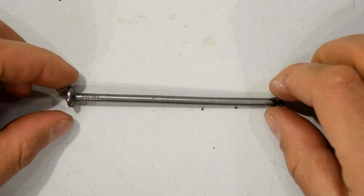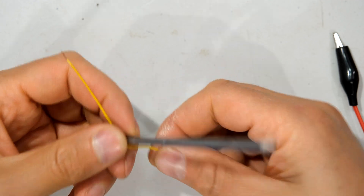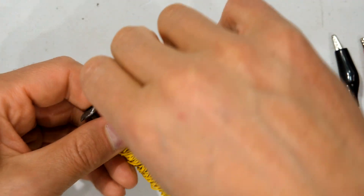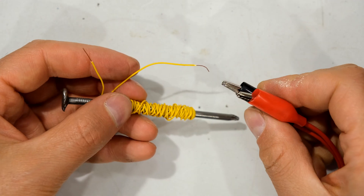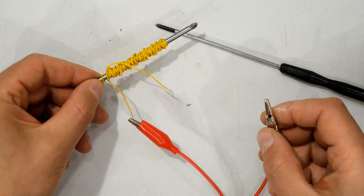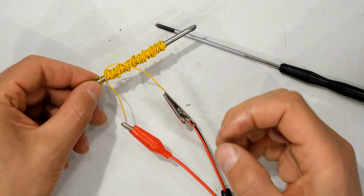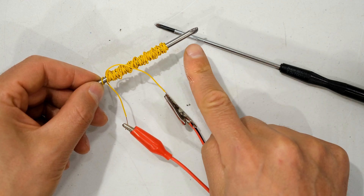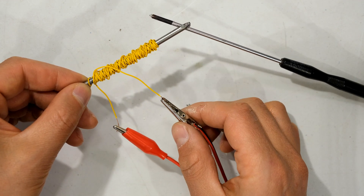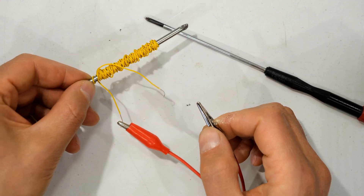The principle of electromagnetism is easily explained. If I take a nail — just a wire nail — and wind a long piece of wire around it, and connect the power supply directly to it like I had with the relay, I've built an elementary electromagnet. Notice the electromagnet is not functional at the moment because the supply is not connected. When I connect the supply, current flows in the coil building up a magnetic field, creating a magnetic attraction, and watch me lift up the screwdriver. Now when I disconnect the supply it loses its magnetic attraction and you can see there's no magnetic force.